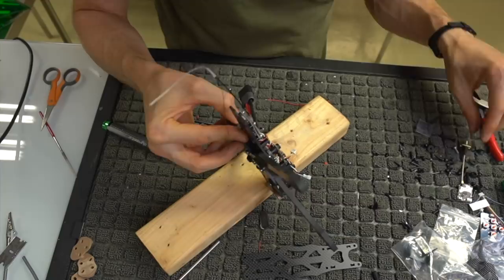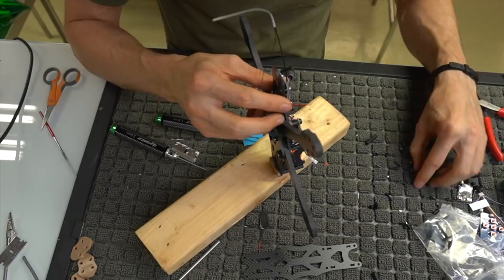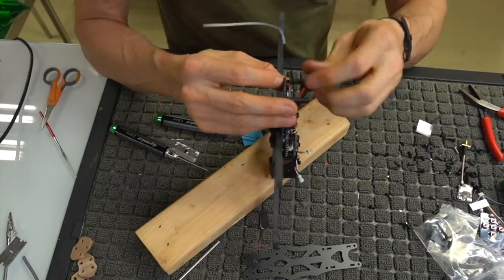We're gonna use the smallest standoff that we have. We're gonna put it here. Again, these are 2mm, they are aluminum, so don't tighten them crazy or you'll strip them out. And then in the very back, I would run like an 8mm at this point, or you could run even steel in the back, but I'm just going to run an 8mm button. I don't know if this is necessary, but I would run a thicker button in the back because why not? You have them. You're not going to use them anywhere else.